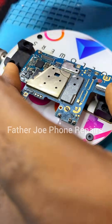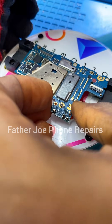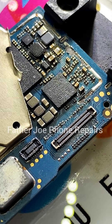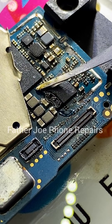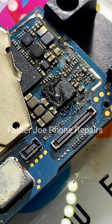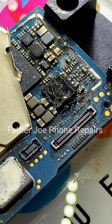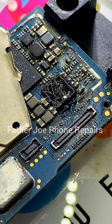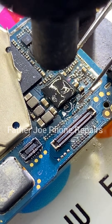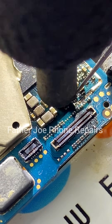My dear technician, welcome to my new video. Let me summarize everything. My technician came from Oron and brought this phone to me. The phone was not turning on — he tried his best but all proved abortive. He removed the shell and tried his best but it's still not working, so he brought it to me for repair. I collected the phone and started troubleshooting. I finally detected that the power IC is not working. The only way to fix it is to remove the IC and re-ball it. If re-balling doesn't work, I'll put a new power IC. I turn on my blower and blow the IC to remove it.